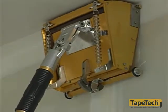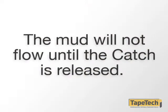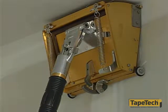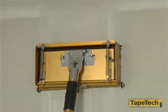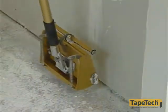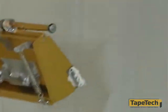This is done by pressing the box against the wall in such a way that the axle is compressed and the catch releases the cog on the pressure plate. The mud will not flow until this catch is released. As soon as the catch releases, mud will start slowly flowing from the box. Move the box along the joint just as you would with any other finishing box. However, you will need to apply very little pressure to keep the compound flowing. The amount of pressure needed will vary with finishing conditions and compound consistency.